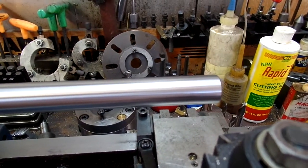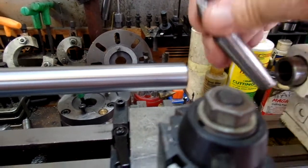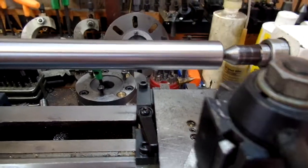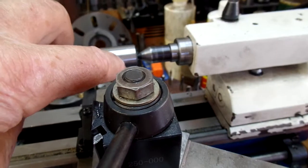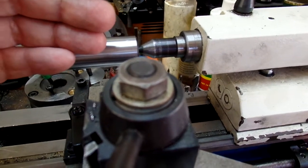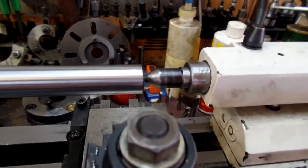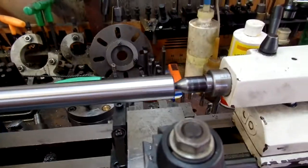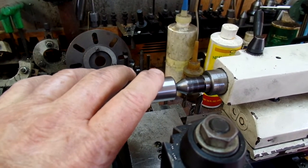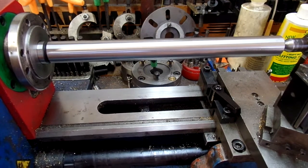You can center the dead center on the bar, and with an indicator, if there's any movement in the bar without the dead center, you can find the average and then run the difference. If the center is pulling the bar off center, it tells you that you need to measure and adjust closely. I finally have mine fairly well set up, but nothing's ever perfect.